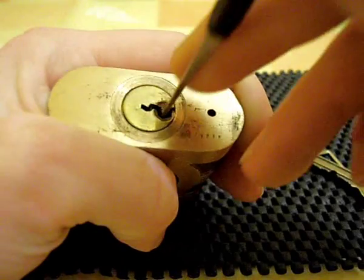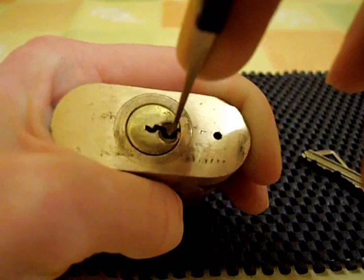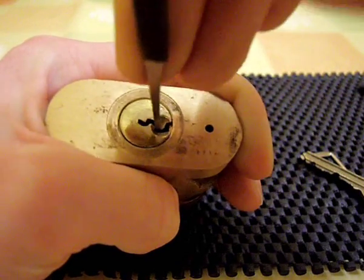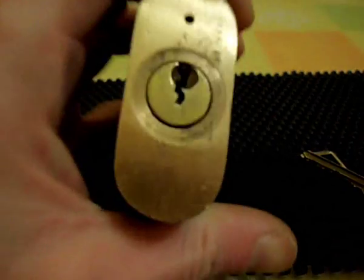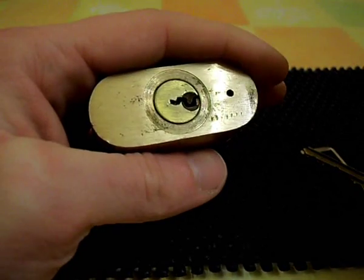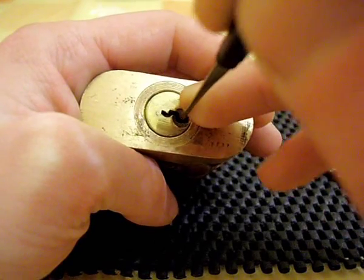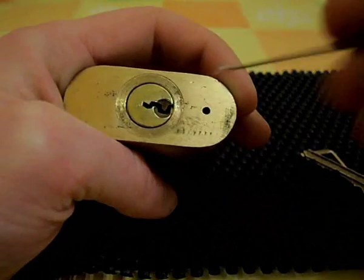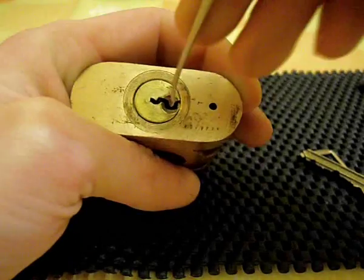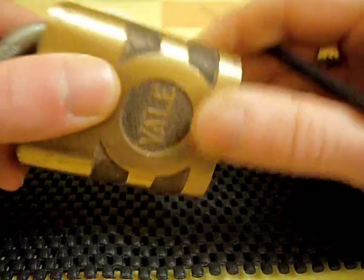What I've noticed as well — inside the lock, if you run your pick across the bottom of the keyway, it's got little holes. If you take a core out of a re-keyable padlock, on a lot of them you've got little holes in the bottom, and as you turn the key all the way around with the core removed, you can actually drop the key pins out of the bottom. I thought it was a little bit strange that it's got those cutouts here in the lock, because it's not really a removable core. But I thought I'd just share that with you.